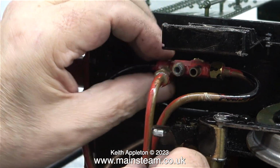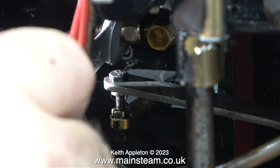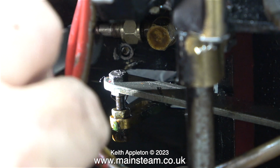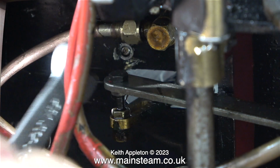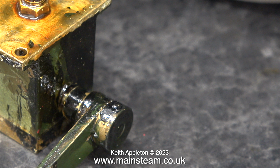Personally, I do not like the Sprag clutch type. I've had problems with them in the past. I really do prefer the standard ratchet lubricator or the Jubilee fittings lubricators that don't need a clutch. An eccentric just rocks back and forth. From my experience, the Jubilee fittings lubricators are trouble-free.